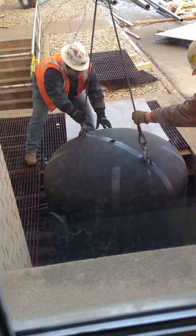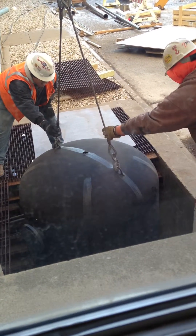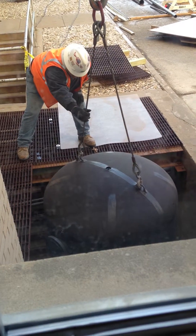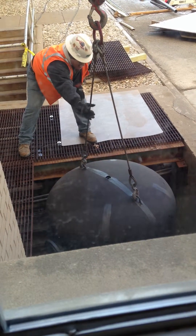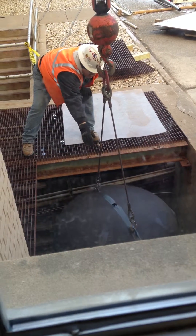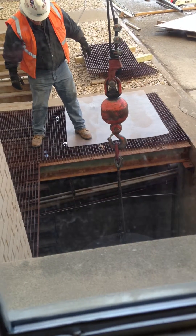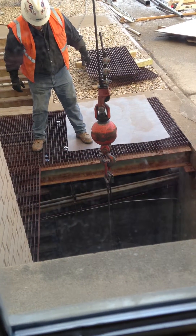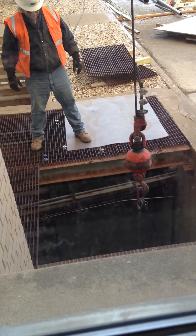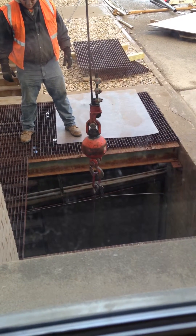We're trying to help rotate it. That's an expansion tank. It's got a big dent in the side of it. It ain't new. The insulation has been scarred. Okay, what does that thing do? Well, when the chill water is returning through the system, it's actually hot — it's coming back because it's absorbing heat, that's how you cool. And so, when it shoots back into the chiller, it expands. You've got to have a place for that water to expand, and that's what that tank is for.